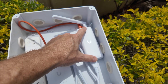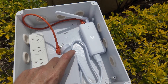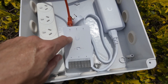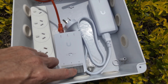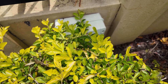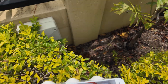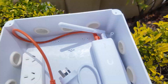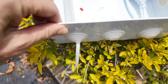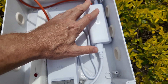This is going to give us up to about 30 watts of power, so this will be enough to then power my UA Hub Mini. My UA Hub Door Mini is then going to be connected - not in the active state, we've got this turned off here. It's going to have its 12-volt openers connected down to my box, and then we'll work out which terminals we need to use to actually activate that. The plan is to get this mounted up onto the wall over here nice and neatly. I've already run through the gland here the four-way and through my waterproof gland at the bottom, so I'll fix that, power it from the mains socket, and then hopefully this will come online and be seen through the Wi-Fi.